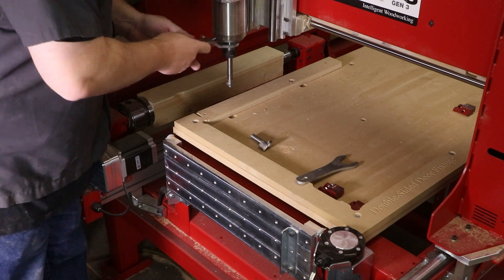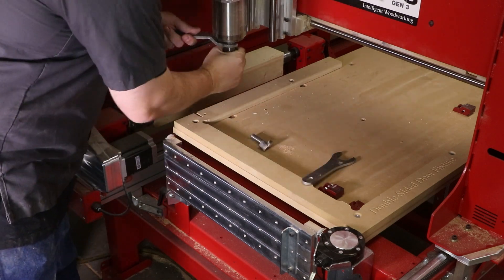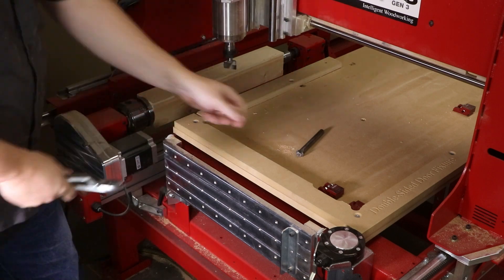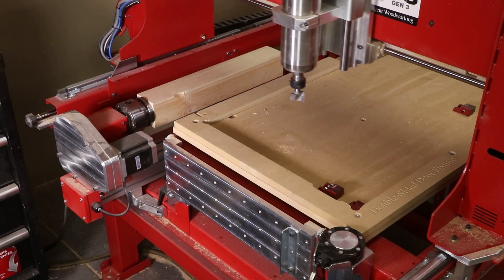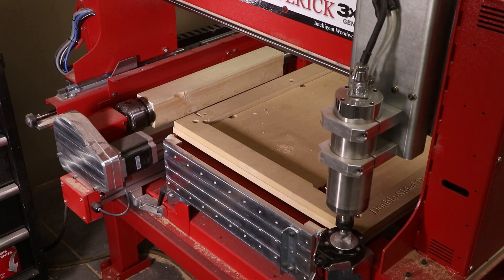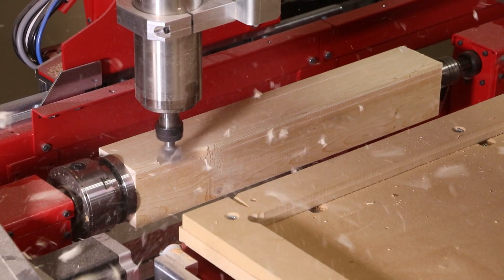The Maverick 3x5 has a manual tool change liquid cooled spindle. After the tools are changed, it touches off the smart tool pad to measure each height, and then the cutters will complete their tool path sequences. The dust collection was removed during this cutting demonstration.